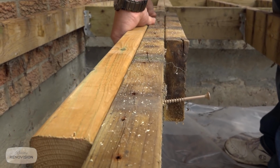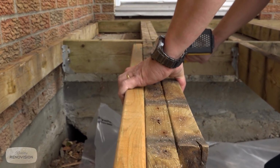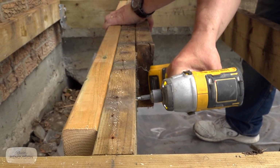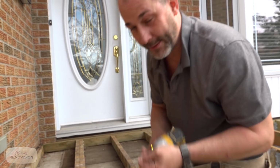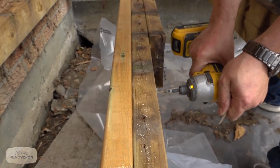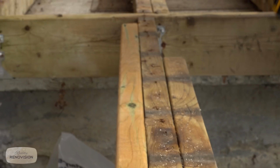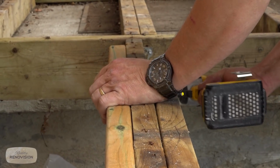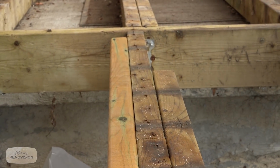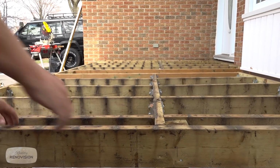When you're scabbing something like this in a wall, using a 1 foot piece is probably fine. But when you're doing it on the floor, you really want to laminate the majority of the board, if not the whole thing. And then here's the key. Every 6 inches, you want to go from high to low to high, like big W's all the way across the board. That's going to give you that strength of a triangle. Wood can't bend if it's attached in that manner. All right. That's not going anywhere anymore. So now it's not just flat.